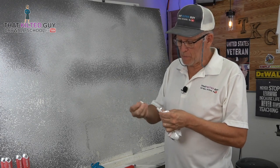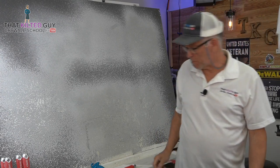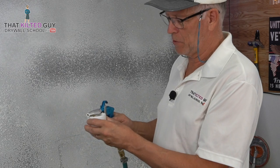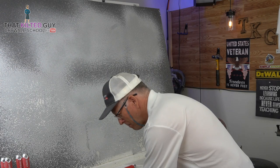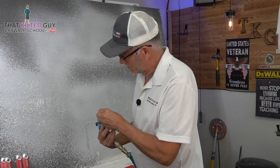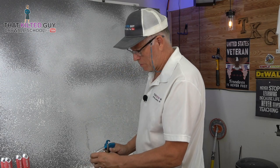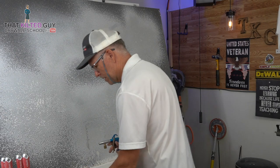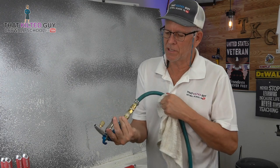While we're waiting on that to finish setting up, here's all you do for cleanup. Put the lid back on your bag of texture, take your gun, place the suction side into a little bit of water, and it only takes about a two-second burst, they say. Then, of course, clean off the nozzle. I'm going to do it one more time because I'd let that sit for quite a while. Wipe off the end of that and it's ready to go for next time — and it looks pretty clean.